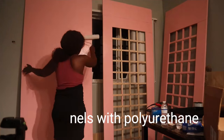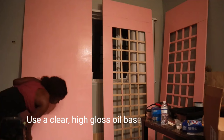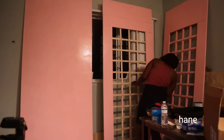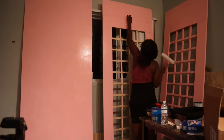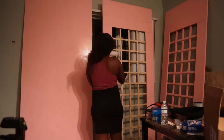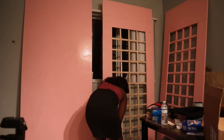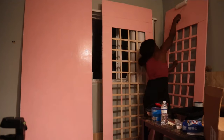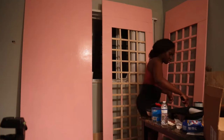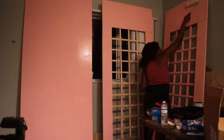Now I'm going to coat the panels with polyurethane. I used indoor polyurethane but recommend outdoor. I also used water-based polyurethane and would recommend oil-based instead — the water-based started thinning out the paint and caused some dripping, which was a hassle to fix. I recommend using an oil-based polyurethane. Also choose one without an odor because this literally smelled up the entire apartment and made it very hard to sleep — I had to open all the windows.